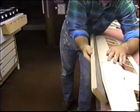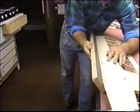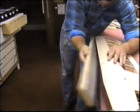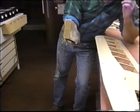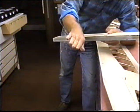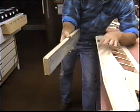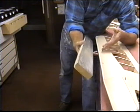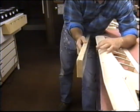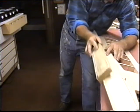Again, the idea is to get both leading edges relatively blunt. You want to see about an eighth inch or a little bit more of that leading edge square. And by the way, it's a significant thing. It's not a little minor baby thing. If this leading edge is too pointy, the plane will tend not to track well. If it's way too blunt, like a jar cover in the front, you'd just be adding parasitic drag for nothing. So when you can see half of that leading edge square, you know you're real close to having it.